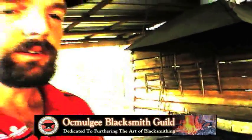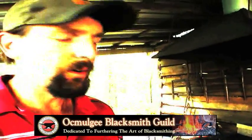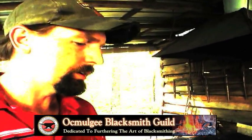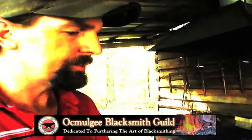While you're forging it, you kind of need to watch your temperature. You don't want it to go over an orange color, because you'll get a little bit too much decarburization. It's a simple steel, 1084.